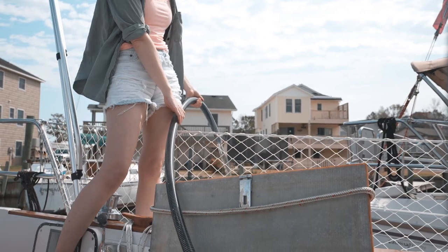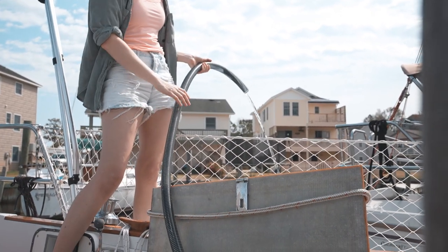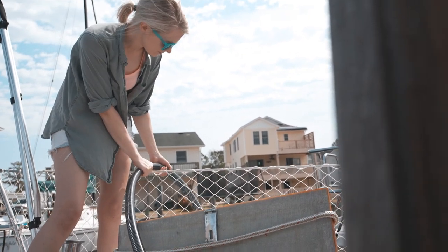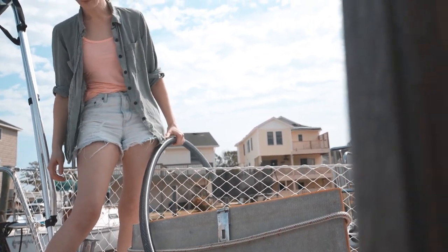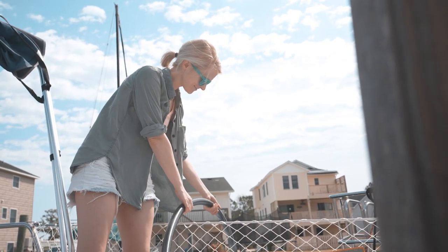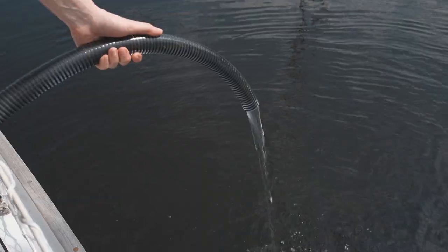Here goes manual — pull it up a little higher — nice. Now I'm going to switch it to auto. Auto is what it's pretty much always going to be on because this is just a backup pump — it's going to click on when we don't know water is coming in. I hear it. Success! We can't put the through-hull in until we're back in our summer marina where we can come in stern-to. We're going to keep the hose easily accessible in a locker so if we do have an emergency in the meantime, we can pull the hose out, throw it over the side, and drain the water out that way. Next step is installing the high water alarm, which will trigger when the float switch is engaged.